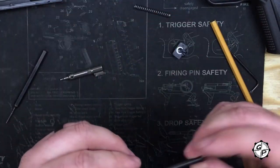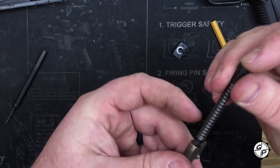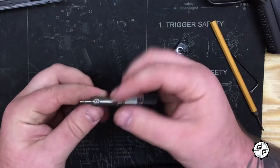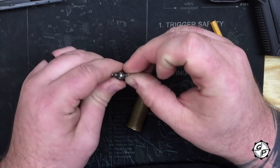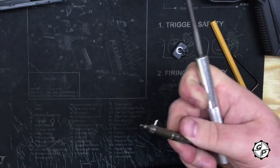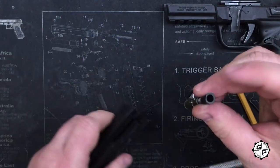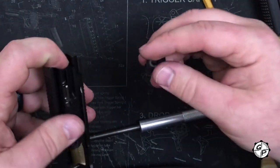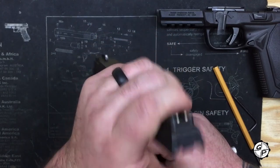Reassembly is fairly simple. Slide that in, put your spring on, push it back into the striker making sure to line up your holes. I'll take a 1/16th punch and use it as a dummy pin. Take my roll pin, stick it in there enough to get it going, tap it with my brass hammer. Once I get it going, I pull my punch out, flip the block over, and hammer it home. Striker's back together. Make sure when you put this back in, the flat end of the striker cup faces the bottom. Slide it in, compress, stick your back plate on, snap it in, and that's it.